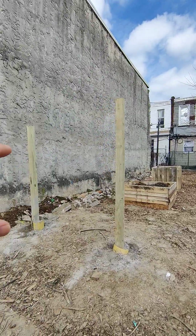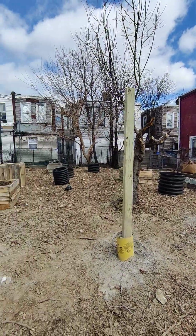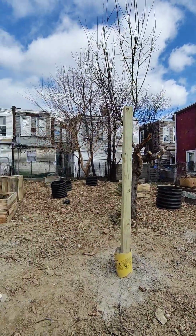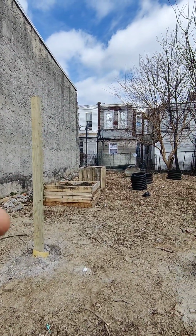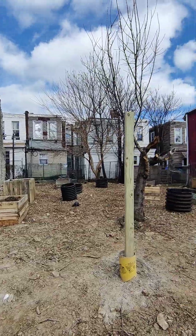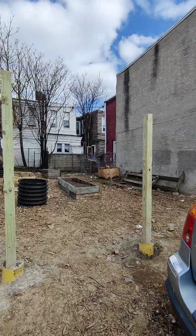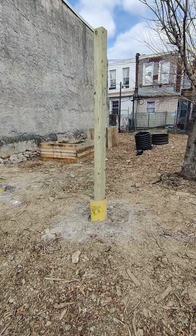And then we're thinking about having maybe 4-foot wire mesh, maybe 12 gauge. I don't remember the number, but a thicker gauge mesh that could go across in the middle, so that we could see through the fence, but strong enough that you wouldn't break through it. And then also having the wood on top, so it's not flimsy and hard. You wouldn't be able to climb it. The reason we want it to be a pretty tall wall, as tall as this one, with the rest of them made up to the height of this one, is because we don't want this to be a climbable fence. So that's kind of what we've got going on here.